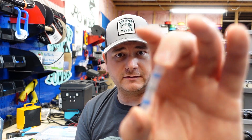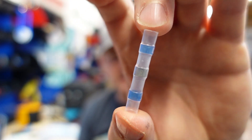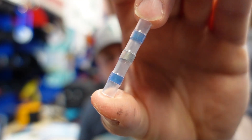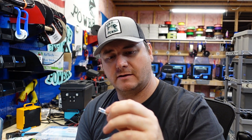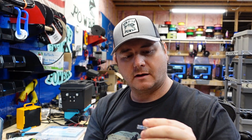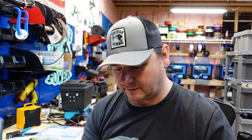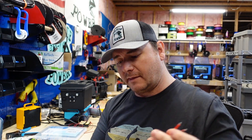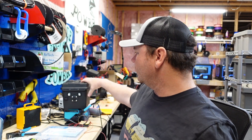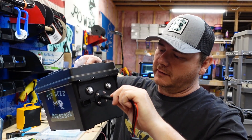In today's video we are going to talk about solder seal connectors. I'm going to show you how to install these things. Pretty cool little gadget. Easy — just put a little heat on it, sucks it right up, seals up those two wires. Pretty easy, especially if you don't have a soldering iron. We send those out with a few of our products, so if you get our new power box we're going to send some of these plugs out.